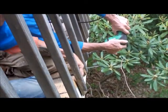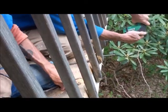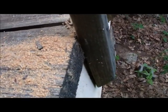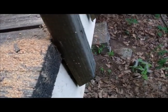If I leave some stuff behind it, you have to clean it out. Probably hit it with a hammer would be the best thing to do first. Oh, that's nice. What we've got going on here is the decking boards, when they were put on originally, come hanging past and left a big gap behind these pickets, which made them very weak. With that big gap, they're only nailed into the deck board itself, right there, and that's just not any kind of strength.